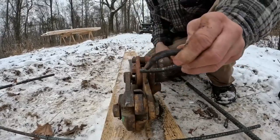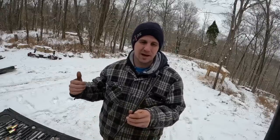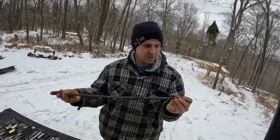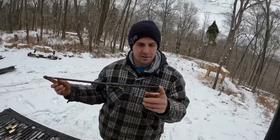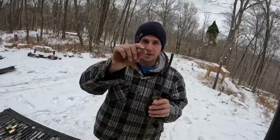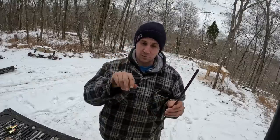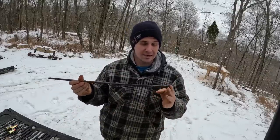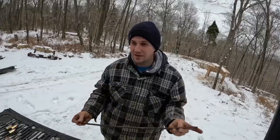Made a shape. I just wanted to show you with that bender, because a lot of people are going to ask in the next video, well, why didn't you just use the rebar bender you used in the first one? It doesn't bend tight enough radius to make the little stirrups we need to make. We're going to use all this number 3 bar to make a stirrup to tie that top row rebar to the bottom row rebar. And where we have two and two, we'll box it out to tie it all together. That one just doesn't bend tight enough radius. So I got to make a jig, and that'll be in the next video. But there we go. Now I don't have to answer that question in the next video, and that's all taken care of. Let's get the drone out.